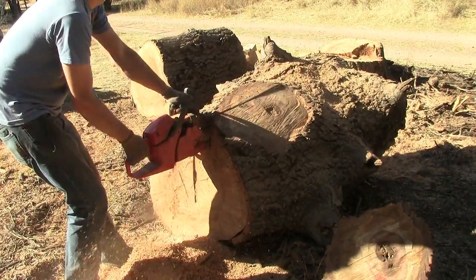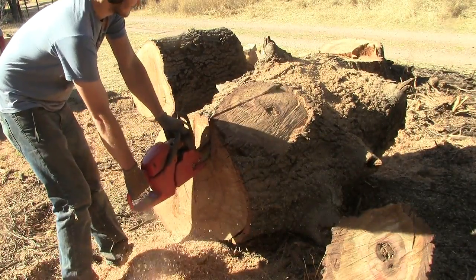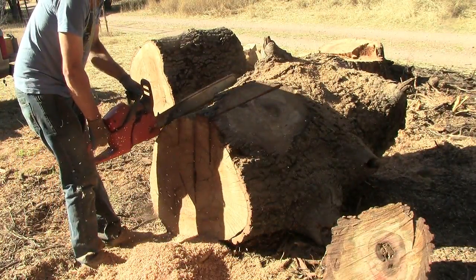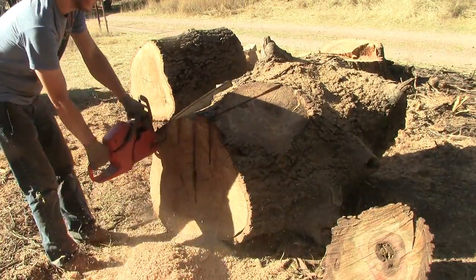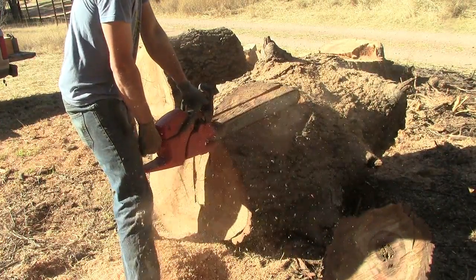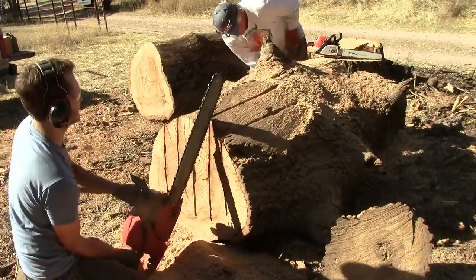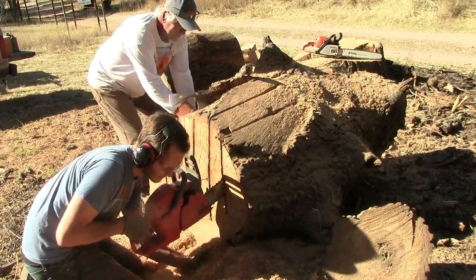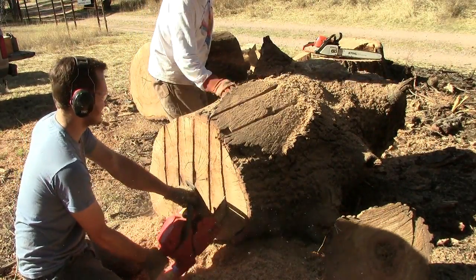I was at this for about 5 hours with an hour lunch break, so we worked about 6 hours total. Cutting parallel to the grain is easiest for the saw — it cuts nice long strips and goes really quickly compared to cutting cross grain, which most chainsaw mills will do. With cutting cross grain, it's hard for the saw; it takes out dust instead of shavings. I have all 5 cuts done and you can see how much shavings it makes — quite a bit, so I have to clear it constantly.